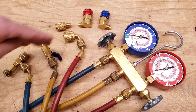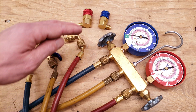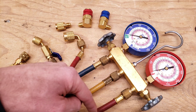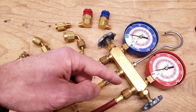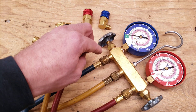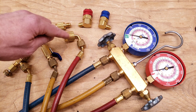The whole point of these fittings is to have control over the refrigerant when you're checking the charge, when you're connecting and disconnecting from the system. With these fittings it allows you to perform things such as a disconnect procedure where you don't steal all the liquid refrigerant out of the system that's in this hose. When you disconnect the refrigerant lines you can actually charge it back into the low side again while the system's running. Remember this is the low side, this is the high side, and I have a whole video on that disconnect procedure in the description below.